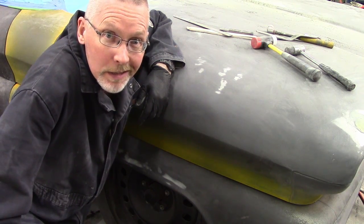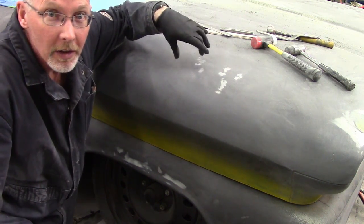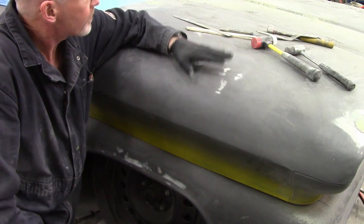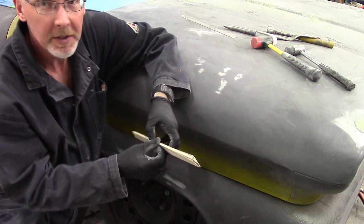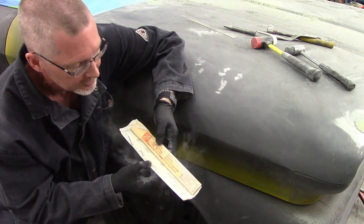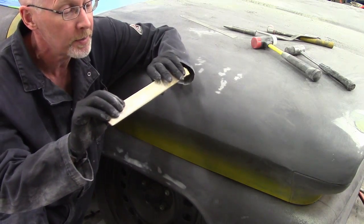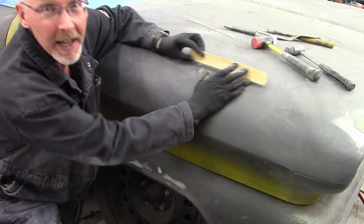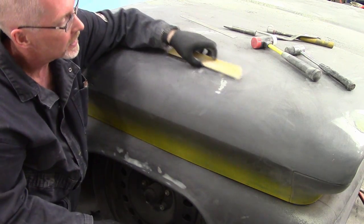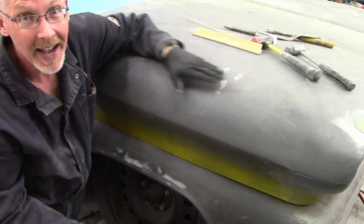So flat paint hides a multitude of sins. One of the things you're going to discover when you try to paint it glossy is you'll find all of your mistakes. So when you spray it with whatever primer, I saw a YouTube video where a guy was just using a paint stick with sandpaper. I like this because it stops me from being really heavy-handed and I have to use fingertips and lightly, gently sand. So I sand in a bunch of different positions, diagonally or whatever, and you'll start to find the high spots.